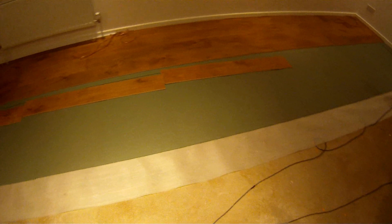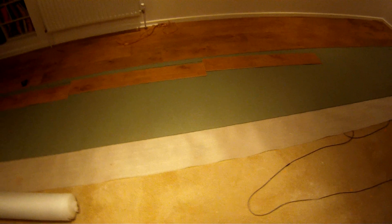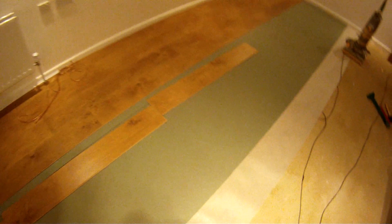A quick mention about the preparation for the floor. We've got a concrete floor and you need to stop the moisture from the concrete getting into the laminate flooring. Normally you'd use something like this foam membrane, or you can use plastic membrane then fibreboard. I've gone for double amounts of insulation as well as damp proofing by using the foam underlay with the fibreboard on top, so you've got twice the normal amount of heating insulation.